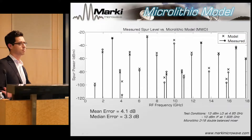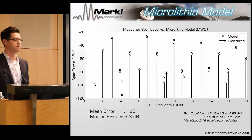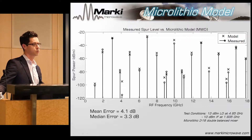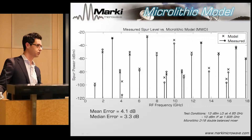Especially when the alternative is for the customer to manually enter a spur table into their simulation. In this case it's a black-box model — just a three-port device. I make no requirement that you surround the mixer with 50-ohm loads. You can put filters, reactively terminate, or in principle do things like image recovery and exotic reactive impedance loading on the mixer.